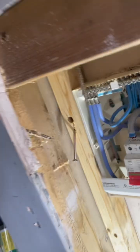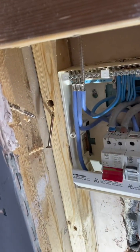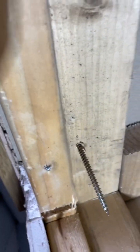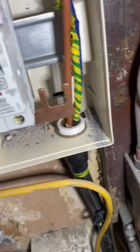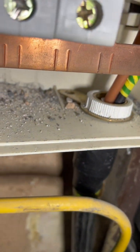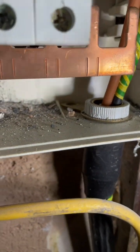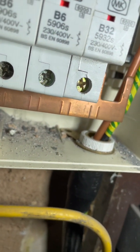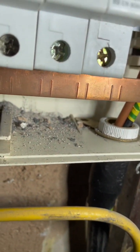I'm going to have to grind this up in a minute because that is dangerous — I've caught my hands twice on it already. I also noticed that the armoured cable feeding the outbuilding is not bonded at all. They've put a plastic lock ring on it from a male adapter and the banjo is just sitting there — it's not bonded at all. I need to sort that out.